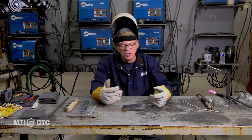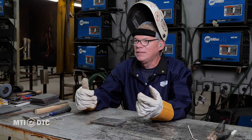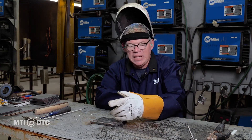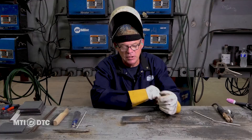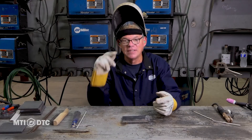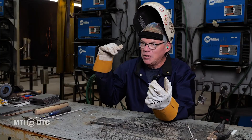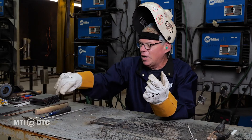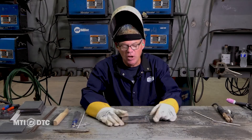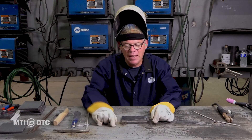So we went through all the positions we're going to talk about — there's our flat. Hopefully you don't have a lot of questions; it's pretty cut and dry. If your amperage is right, you're comfortable, you've got some clean steel, and your rod angles are right, you're going to produce something that looks like a weld. And then it's just practice, practice, practice. It's just like putting your fingers on the fret of a guitar and strumming — that's a chord. But now we've got to do repetitive, repetitive practice. Nothing comes easy. All right, so that wraps up the flat portion of this video. The next video we're going to talk about is 3G, which is uphill. Thank you.